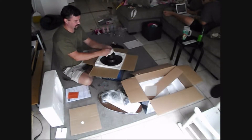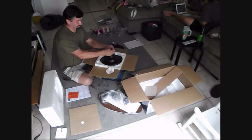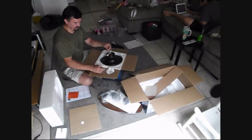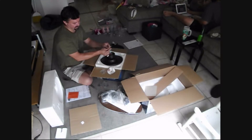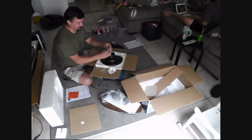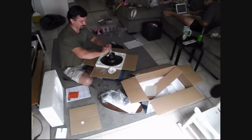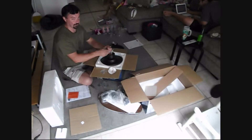Here we are doing our white wires. We've got the white wire here — it already has a wire nut, so we don't even need to use the wire nut we had from before. When putting the wire nut on, you just put the two pieces together, slide it over both, and let the wire nut actually twist them together. Don't try to re-twist your wire — it won't help you at all. The white goes with the white, and then the black goes with the blue, because the blue is always the light wire.